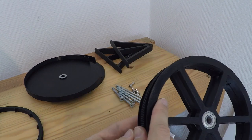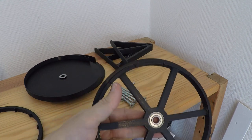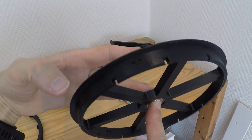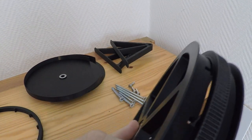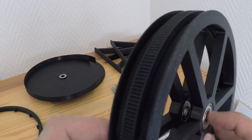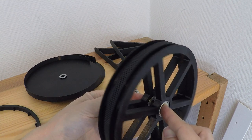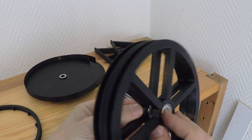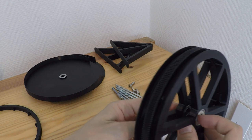Here's another gear and a spool. This is one spool — it has a bearing in the middle. The previous prototype had a loose part to push against the core of the bearing, but I've designed that away. Which means if you see in between the bearings, there's nothing supporting there. So if we're pushing on the cores of the bearings, they won't work very well. So we can't have a screw there anymore — we will be using smooth rods that won't compress the bearings.